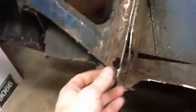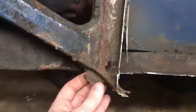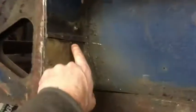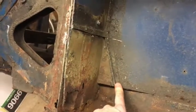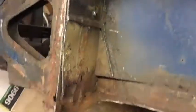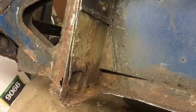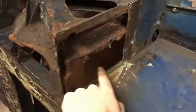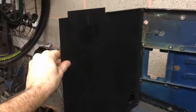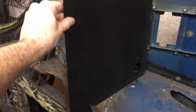As I've cut it out I've noticed quite a bit of corrosion around the bottom part of the hanger, so all of this is going to need to be rebuilt. You can see the toe board has been cut out and we'll be drilling out the spot welds to allow a new toe board to be put back in. I've cut back here, the new piece will be cut out to suit, the edge trimmed back, and the front tidied up. Now if we take our repair panel, it will fit in — it'll need a bit of fitting and tidying up but it's ready to be fitted.